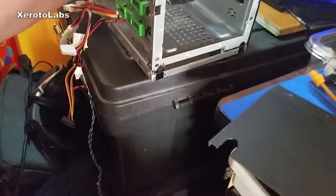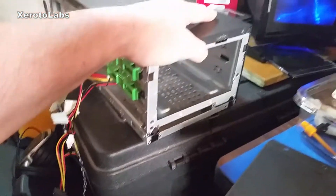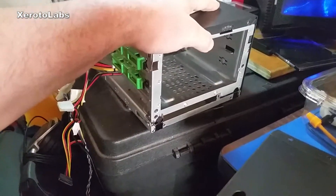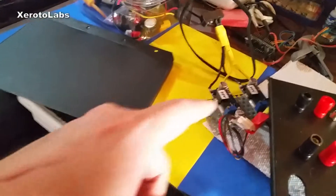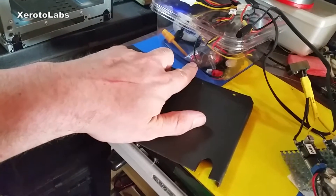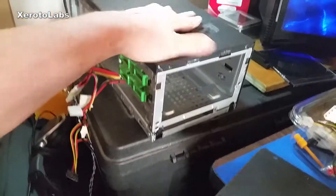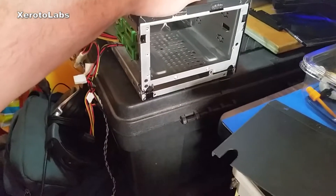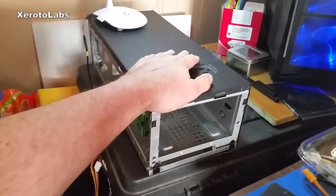There is plenty of amperage from that style of power supply for the 5 and 3.3 volts — it's not too bad for the 12 volts on this one. I was going to take one of these 12 volt rails and bump it up to the dual 30s to run these fellows. Then taking some spare lugs, I was going to run those off the bottom, and that was going to be my bench supply right there. It was probably going to sit right there, and I was probably going to put my fabricator mini on top because it's about the right footprint.